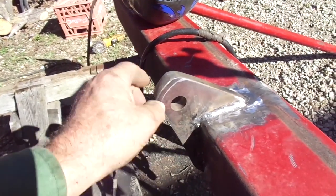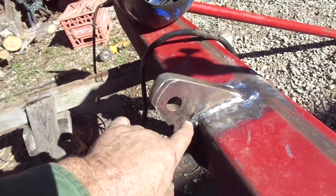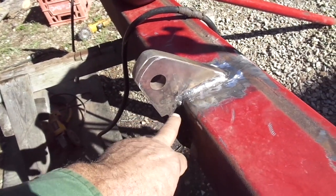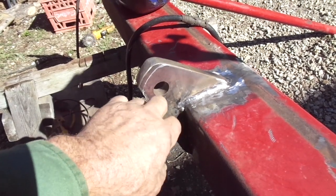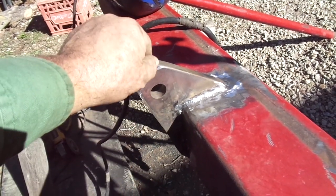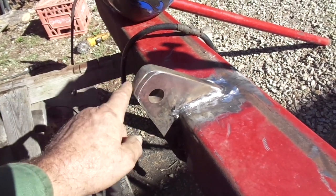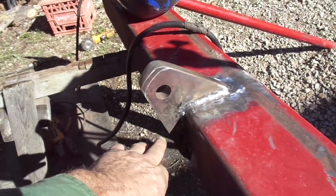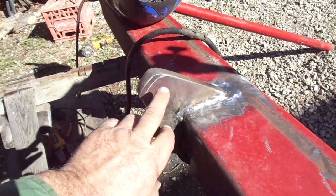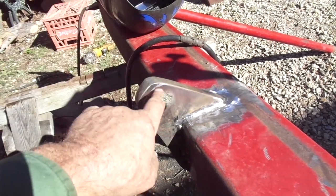So we had to replace that with new 3/4-inch steel, and we went ahead and cut that with the plasma. I still have to make one final pass on this — this is just the root weld and the filler weld. I still got one final pass. And then I've got to trim this; I kind of miscalculated a little bit and ran off the back. I free-handed this tail end. I used a straight edge on the 90 and a straight edge with the plasma torch, but I free-handed the circle and I kind of missed my mark. So I've got to trim that.